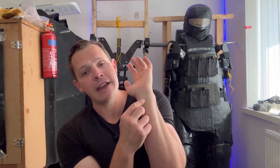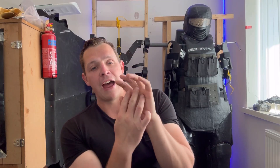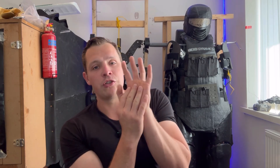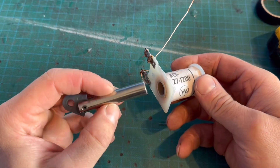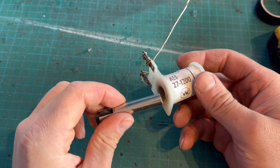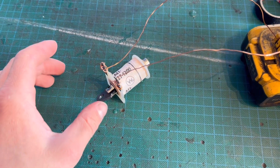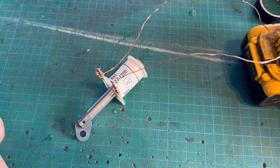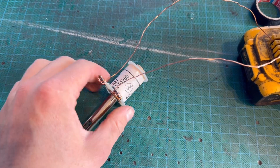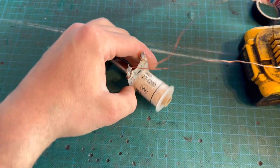A human hand works mainly by tendons and muscles in the forearm that connect up through the hand and move your fingers. This is something I want to avoid on the robot — I really want to get all of the controls in the palm of the hand. A friend who works on arcade machines, particularly pinball and claw machines, showed me very basic solenoids: a large amount of coiled copper wire wrapped around a sleeve with an iron rod through the middle. When you put electrical current onto those coils, they magnetize the iron rod and it slides into the center. These are easy to activate, fast, and crucially can be custom sized to fit in the palm of the hand.